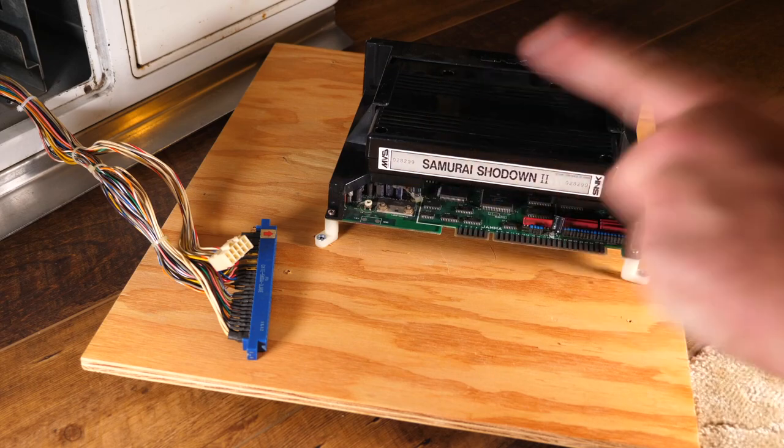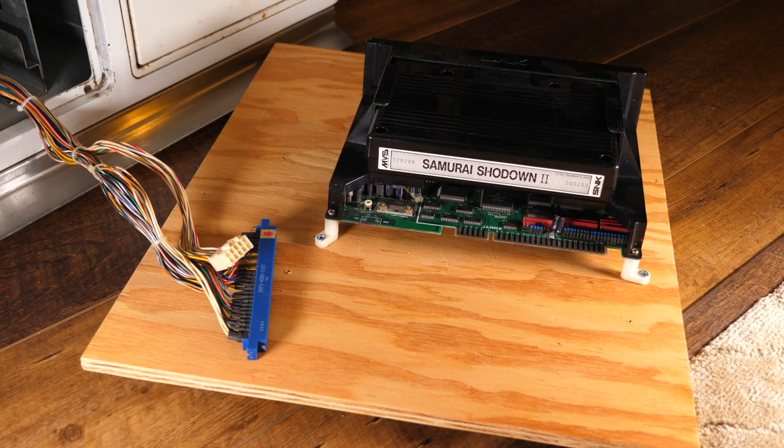And this is literally just the other side of that socket. So when I put Street Fighter 2 in here, I made a little adapter where one end plugs into the extra button pins on the Street Fighter 2 board, and the other end will just plug into this. And then we'll also have to install the extra button harness in the control panel, which is like a 90-second job or something. So, no big deal at all.